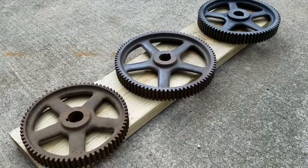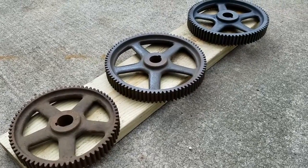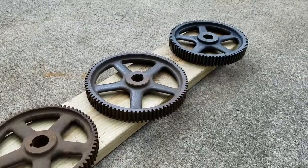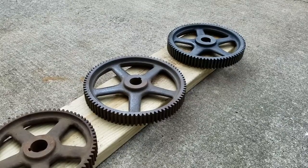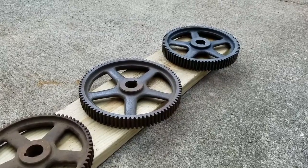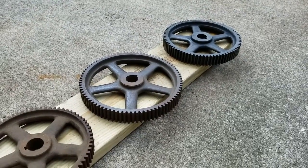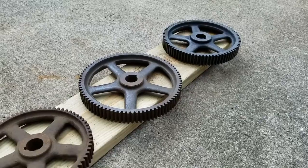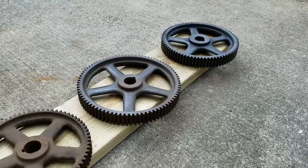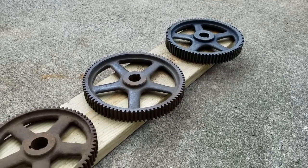So here we have our three stages of grief. On the left we have the part as it arrived. In the middle, brushed with a stiff nylon brush just to get the dirt and grime and dust off of it. And on the right we have the part after it's soaked overnight in evaporust. I did brush it a little bit while it was in there with brass wire brushes and hit it with some really fine steel wool in a few places. I just pulled it out, rinsed it off with a hose, hit it with WD-40, wiped it down, and tried to get the water off of it.